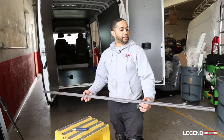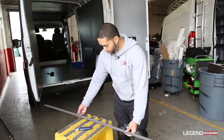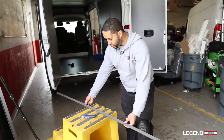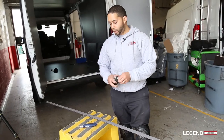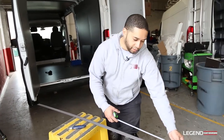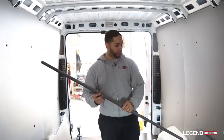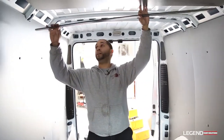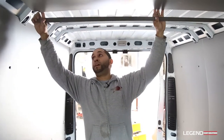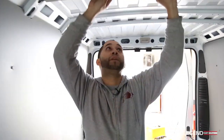The connector piece usually comes a lot bigger than what you need. Measure the ceiling where it connects to the panel. I got 56 inches, so I'm just going to measure 56 inches and cut off what I need. Once you're done with measurements and cutting, it just snugs right in. The good thing is, if you're following the video, you already cut off the extra insulation so this can fit in properly.